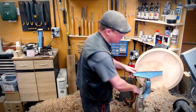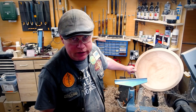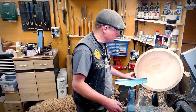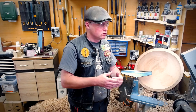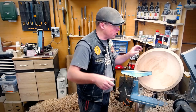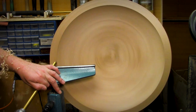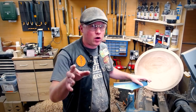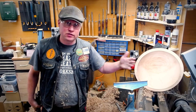I'm happy with that. It's a fairly uninteresting piece of wood, so I'll have a play with it after I've done the rim, because I forgot to do the rim earlier on. What I normally do on bowls — certainly for the last year at least — is put a little scallop on the bowl rim rather than just leaving it completely flat. I'll do that with the three-eighths gouge. The tool rest is at a good height, so I'll take some very light cuts just to put a little scallop on that rim. Now we've got to do some sanding and then some colour — some of you aren't going to like that, but wait till you see what I have in mind. Although you would have already seen the finished piece at the beginning of the video, of course.